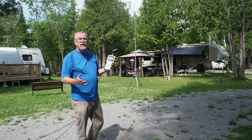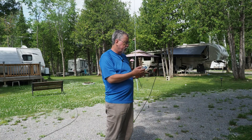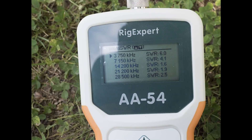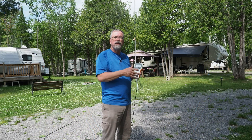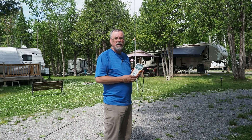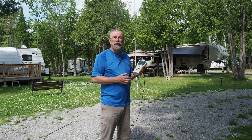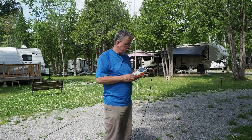I've got the antenna hooked up to my antenna analyzer here. This is the Rig Expert AA-54. I love this little unit because it can measure multi-bands. So here's what I got: 6.0 on 80, 4.1 on the 40 meter band, 1.6 on the 20, 1.9 on the 15 meter band, and 2.5 on 10. So you could actually use it on the three upper bands without an antenna tuner. But using the little LDG tuner on my rig, it does a great job. Today's field day, so there's going to be lots of stations out there.